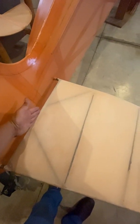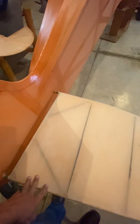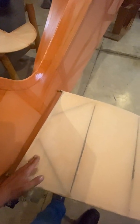Anyway, on the standard design, this tube right here would actually pull in when you tighten up the fabric. And so that's what I had. Mine were actually bowed in, and it looked stupid. One of the things I'm going to be doing is making fairings that go here to get rid of this 90-degree angle here and to reduce drag on the tail.